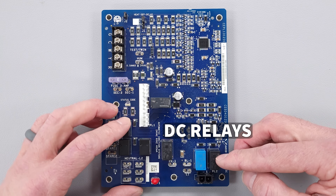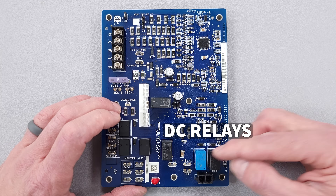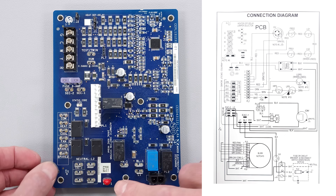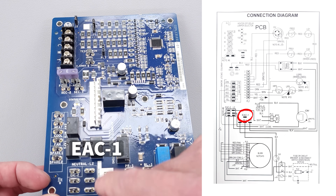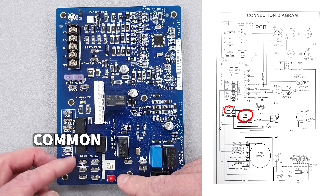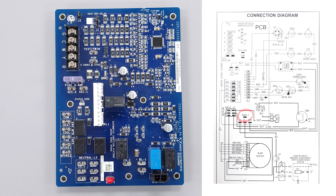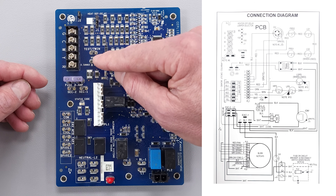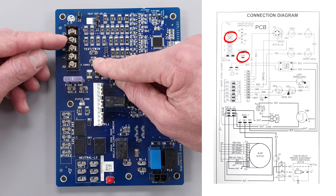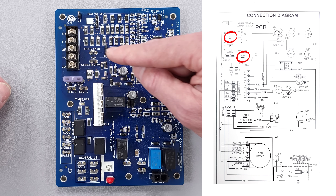These little black boxes are typically direct-current relays, and they're just going to have a set of contacts that either open or close. Boxes like this are used for the HSI and the inducer motor in order to apply that 120-volt power through the hot wire. The EAC terminal is going to have 120-volt hot on it any time the fan motor is running, so it's going to be able to power an electronic air cleaner - here's the common and here's the hot for the EAC. If you want to power a 24-volt bypass humidifier, you have your hot and your common for the 24-volt circuit going over to the small electrical solenoid on the humidifier to allow water to flow through any time the fan motor is running.